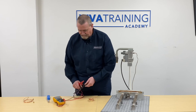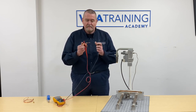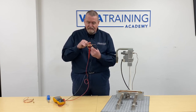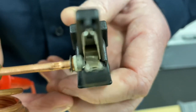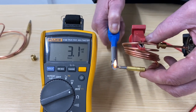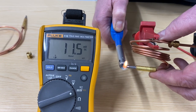I need to connect up the probes — they're on crocodile clips. The red crocodile clip connects onto the copper sheath. The black crocodile clip goes to the back of the thermocouple where it enters the valve — there's a little silver bobble where the two wires, including the titanium or platinum wire inside, come through. We connect that one onto that end. Once we've got it biting on there, we warm up the end of the probe and we can see the figures going up. Once we take the flame off, we'll see the figures going down.